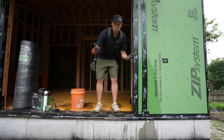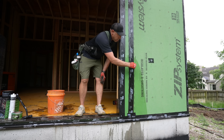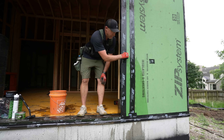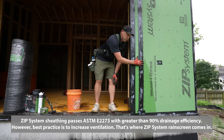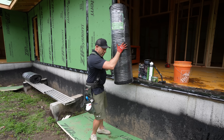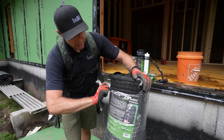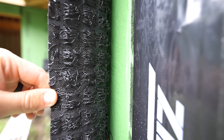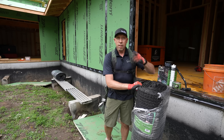But imagine that you took clapboard siding or a sheet good to make up your exterior cladding and adhered it to the panel with nails. Every time water hits those boards, that's a dam, and every time it's held in suspension between this sheathing and that cladding, that's an opportunity for the water to work against your integral membrane. If it reaches the nails, it could even work into your substrate. Enter the Zip System rain screen fabric. All a rain screen is, is a drainable cavity that allows water to get down and away. Zip has designed an entangled mesh that stands off about a quarter inch from the fabric, and that quarter-inch space will allow any water sheeting down the panel to still find its way down and out even after the cladding is nailed over it.